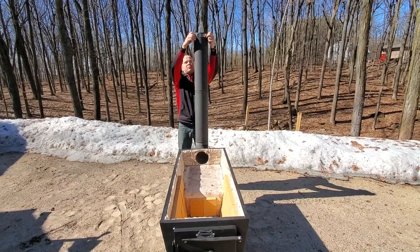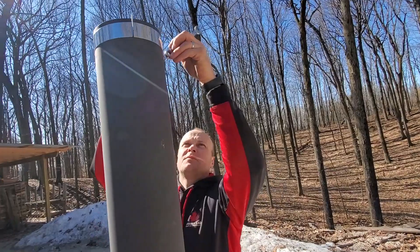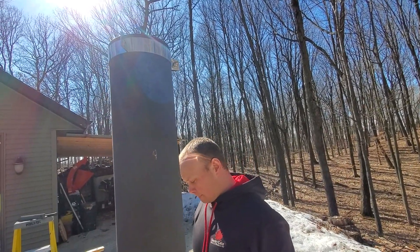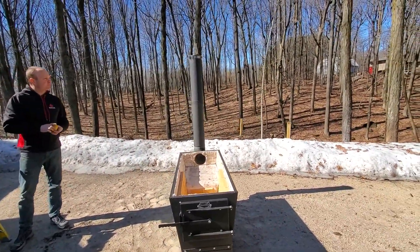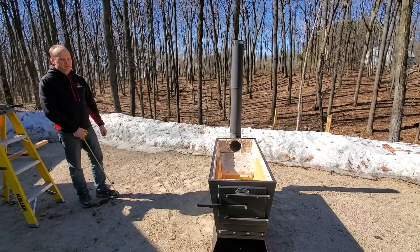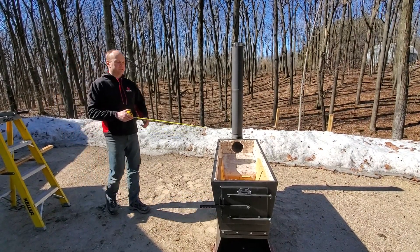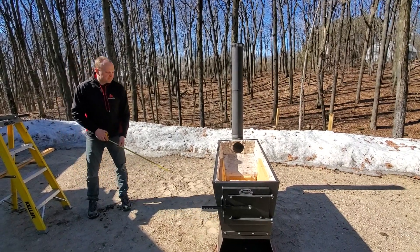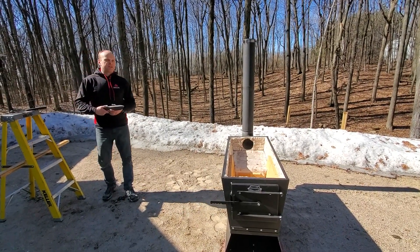There's a third one that's going to go down to the ground behind me, completely out of the way. Your bolt joint is at the back. I'm going to tighten it just a tad. Then I'm going to measure — I'd like to have the guy support centered on the arch, a few feet away, so it's pretty much out of the way and we can operate the draw-off valve. I'm going to run the support to about four feet away, same on both sides.